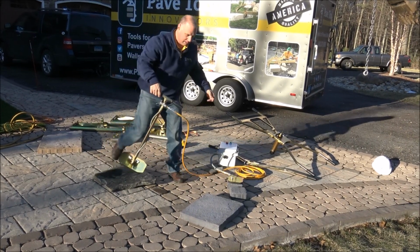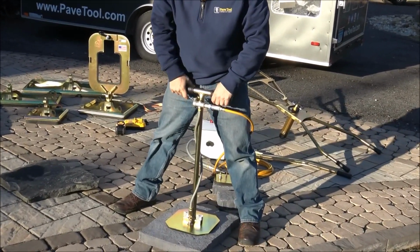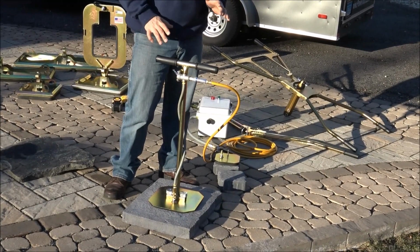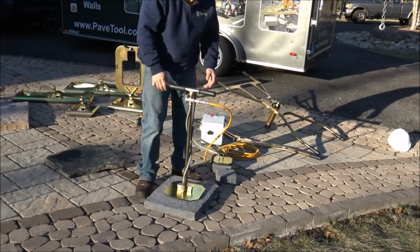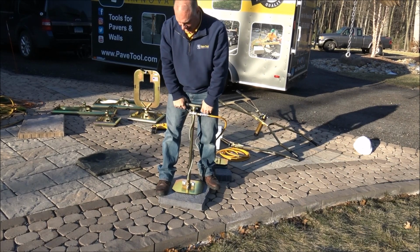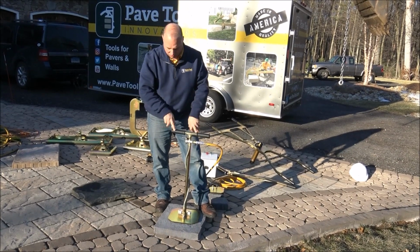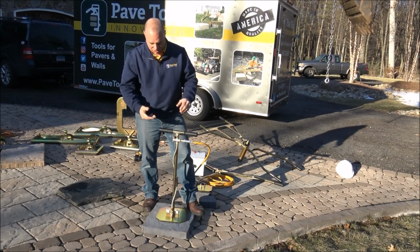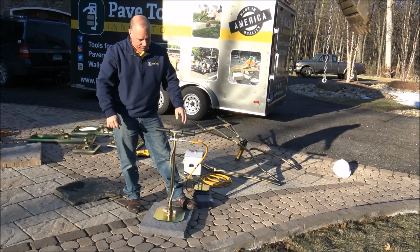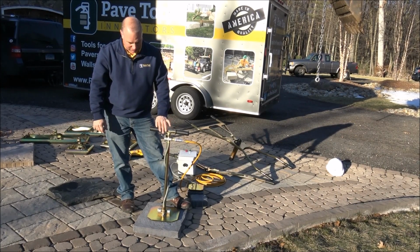Now then move on. Again, any of your wet cast products, you're going to be able to pick right up to that. You can hear it's going to shut right off then. So you're not constantly listening to that compressor running all day long. And again, it's on. We've got our suction. And again, to pull this off of here, you're not going to pull it off. With a wet cast product, when the surface is sealed tight, it's virtually impossible to pull the suction off of there. If you wiggle it, you could probably do it, but again, extreme weight you're able to pick using suction.